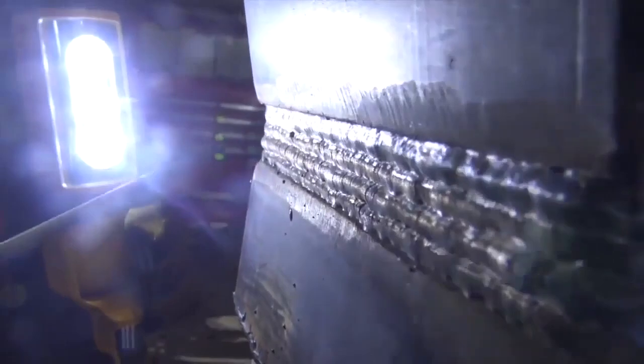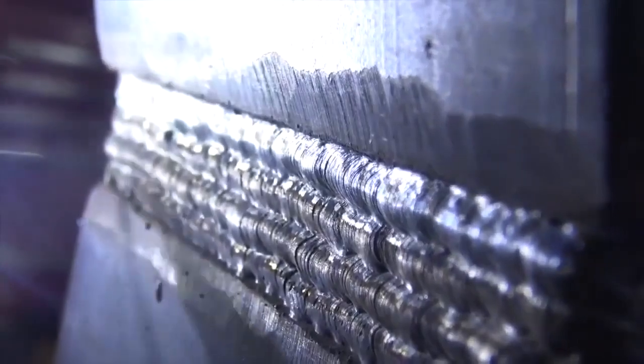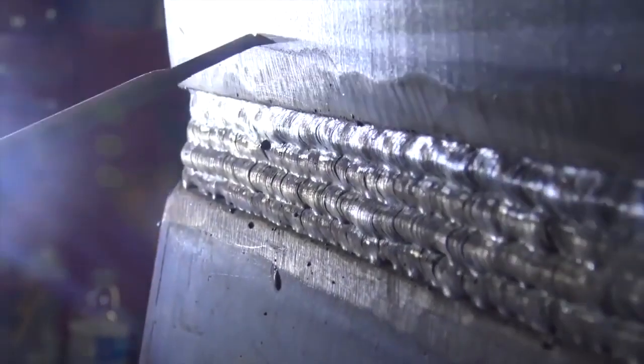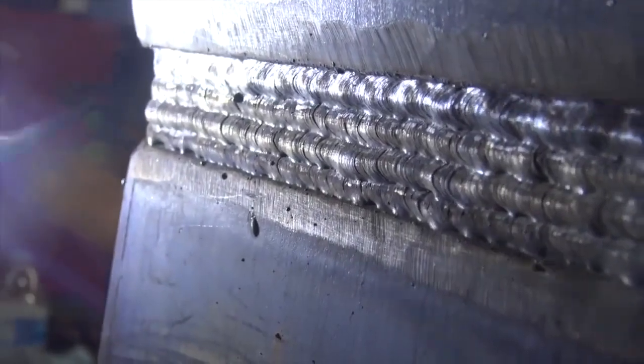So after a long time welding, Mr. Steven Leone appears to be ready to put down a cap pass. We have built ourselves up to flush — one, two, three, four welds in there. The edges of the plate are complete. Our bevel edges, however — our crisp edges — are still there for our visual aid. So now that we are flush, we're going to run one on each edge, a couple in the middle, maybe three, and then cover up the edge. Don't come too far outside. We're going to come out about a sixteenth of an inch overall — maybe a 32nd on either side. We're not going to try to come over an eighth. If the plate is flush and you have no undercut, perfect. If you're up a little higher, even better. We're just going to run these cap welds now and finish this off.